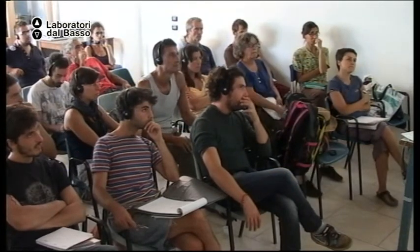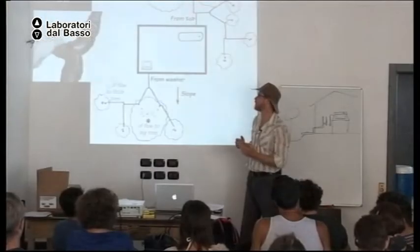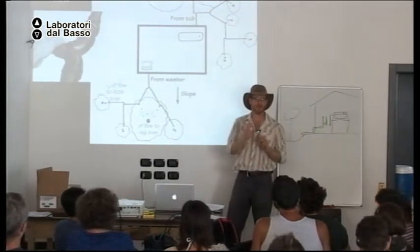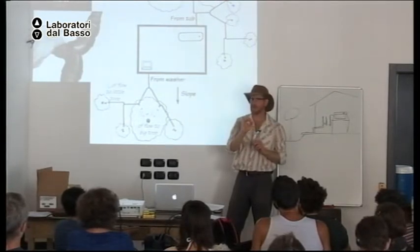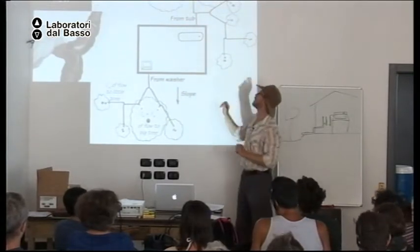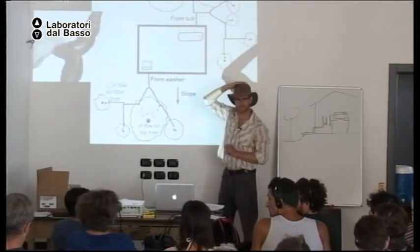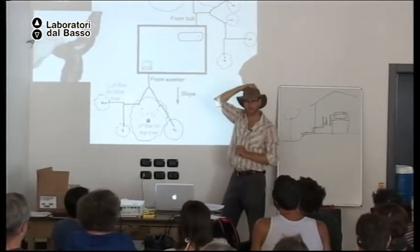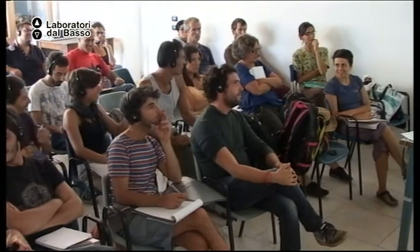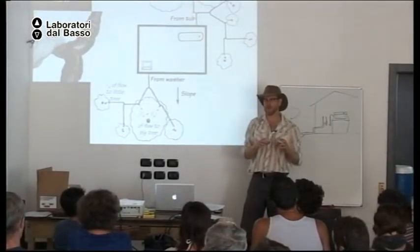But I follow code for the diameter of the pipe, building code. So usually if we have a bathtub, it's a 50 millimeter diameter pipe. 50. And when I come out with a 50 millimeter pipe, if it is 75 millimeters or bigger, it usually has toilet water in it, and I don't want it.